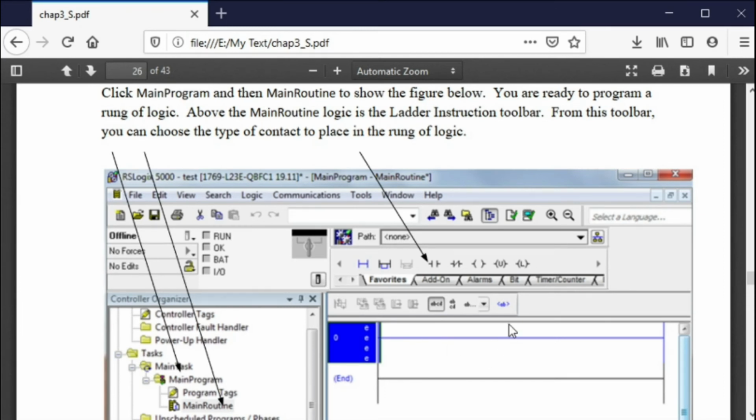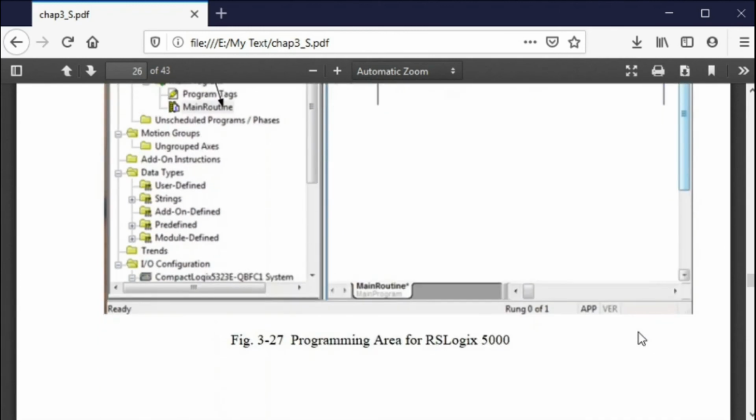And this screen right here allows you to start doing programming in this area right over here. Normally open, normally closed contacts, coils. They don't use a closed O, they use a bracketed O for the coils, but the coils are located over here, and that's how you start.